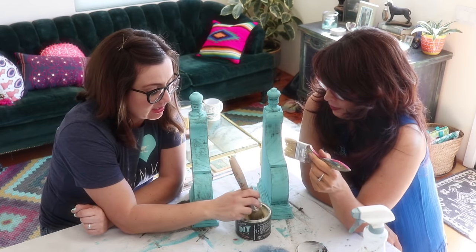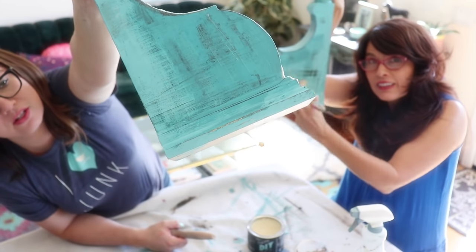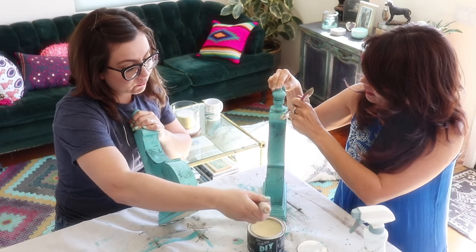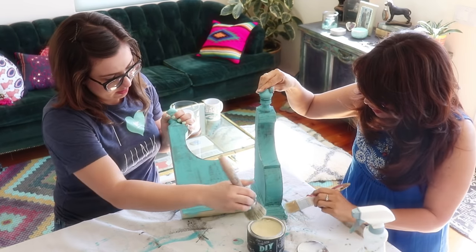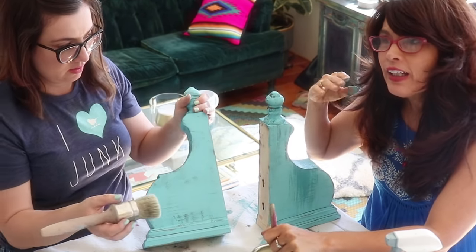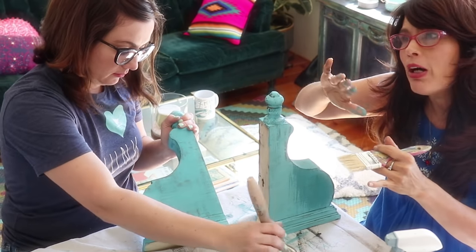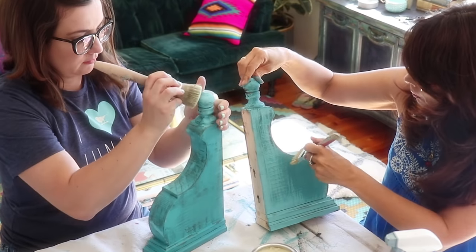We're going to be using DIY wax, which is amazingly creamy. We're just going to put this on and it helps seal it. When it's wet it really intensifies the color, and when it dries it'll not be as intense but more intense than it was before. Do you know about the wax freak-out factor? When you first apply the wax, a lot of times it will look patchy and uneven and people freak out thinking they've ruined it. The paint can even look translucent, but you let it dry and it evens back out. Then it's kind of dull and gummy looking, and then you buff it — and then it's this beautiful, buttery, smooth gorgeousness.